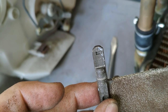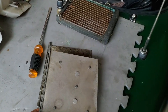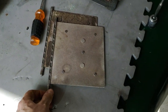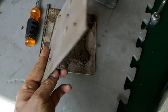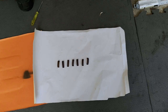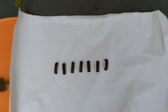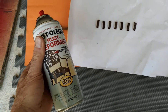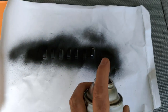Remove the old foam and adhesive with a wire brush. Once that's done, you can wash it with some soap and water or spray it down with a degreaser like brake cleaner. Make sure to let everything fully dry before proceeding. The spring clips looked rusty, so I hit them with some rust protectant paint — I did the same with the control cable retaining clips as well.